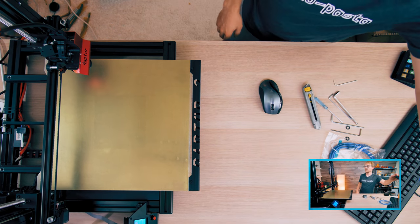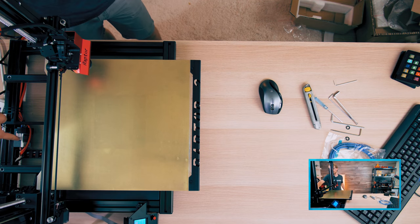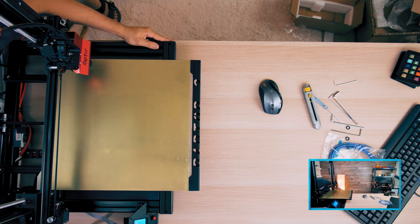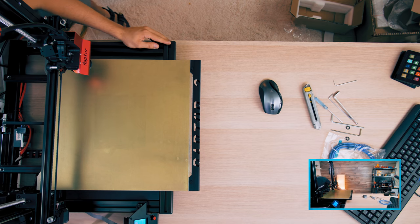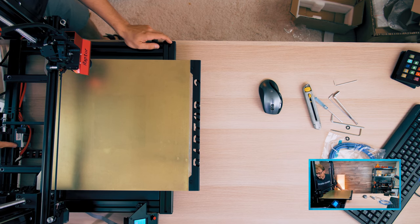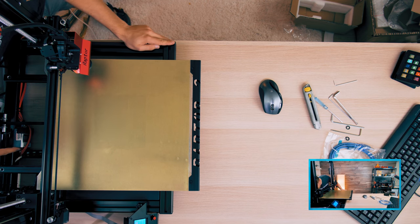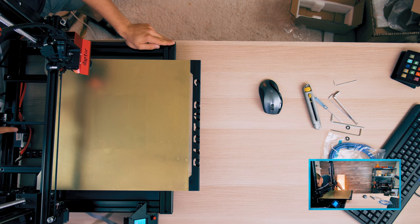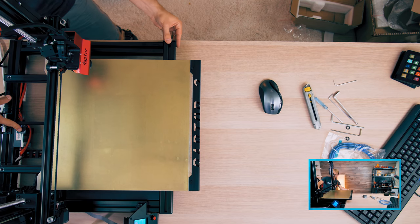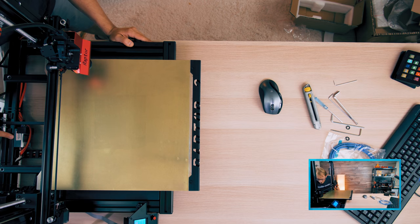The bed is 220 volt AC. Yes, actually, we can see that in the top view. Actually, you can see it right now. This right here, this is an SSR. Yeah, that's not to spec, or not to our standards, let's put it like that, to code if you're in the US. There is a cover on, well, hold on, this is the low voltage side then. Okay, so there is a little cap over the high voltage side. So yeah, I guess that's all right. Keep pulling out this end cap. So yeah, there is a pretty beefy SSR in here.